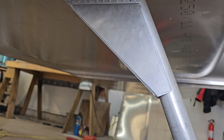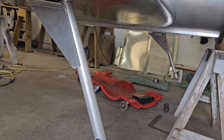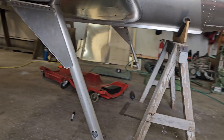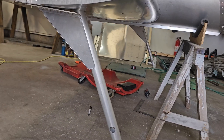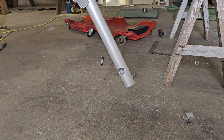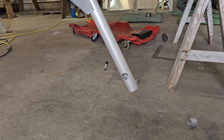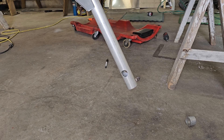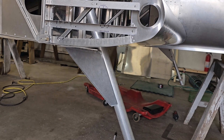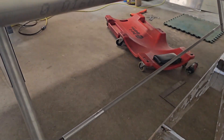That's not looking too bad — things seem to be lined up okay, but we need to put something in between the two axle holes to make sure it's 100% straight across. Before I do that I need to make the spacers that go through the axles. Didn't find the right size tubing, so I got some bar stock — I'm gonna cut it to length and bore the center out to 5/8 inch for the axles. Then put those in, find something to go across, line it up, drill there, and weld the spacers in.